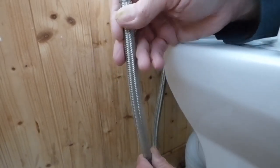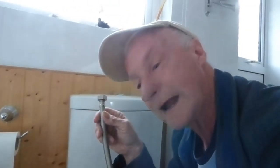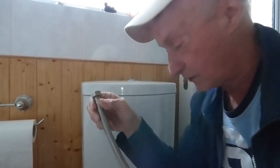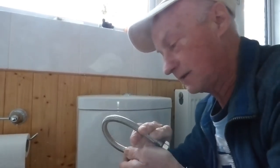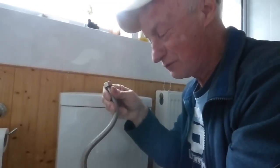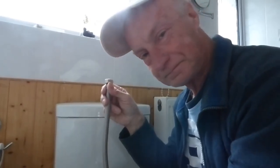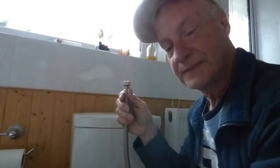That's the idea of these — you can bend them as you want to take the set out. Years ago when we had to do a copper pipe we'd have had to bend it on a bending machine. When you fit a new toilet or new taps, you'd probably have to fit a new piece of pipe as well because it was short. But with these now you can obviously set the angle as you want — no problem. It's fine to bend them that much, but don't go too far. Don't go as I've seen — connecting on a pipe like this and going sharply up like that. That is not how to use a flexi. Just a nice smooth bend to your fitting — something like that — just don't go too much.